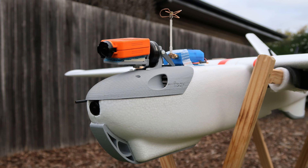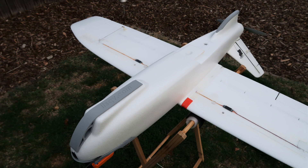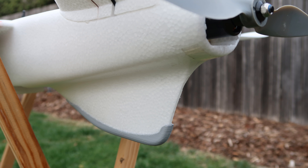The 3D printed canopy should make the plane a lot more aerodynamic than the old one — you can see the old design had the FPV camera hanging off to the side, which wasn't aerodynamic. Underneath, I've used the latest front and rear skids. I'm not sure how the prop will go because I use a 9-inch prop, and using this rear skid means I'm not using the one-and-a-half inch plywood piece that normally sticks down the tail fin. So the prop doesn't have ground clearance by about an inch — if it's still spinning when it hits the ground, it will get chipped.